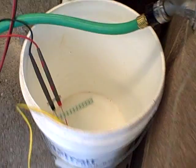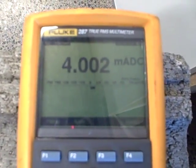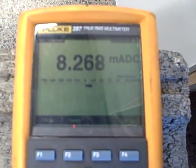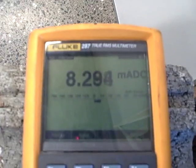On our meter over here we have very close to four milliamps output. As I crank the water supply going through the flow tube, there's a little bit of a lag time — eventually it calculates it and there it goes. Our max flow out of our water supply here looks to be a little over 25% of the calibrated range of the transmitter.